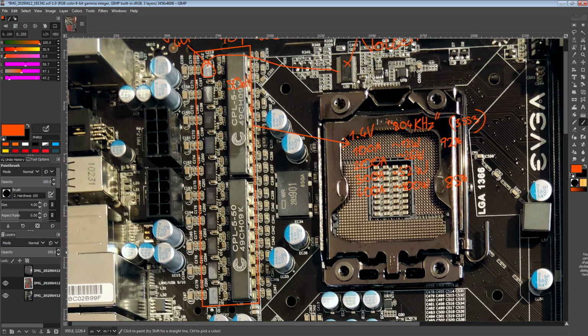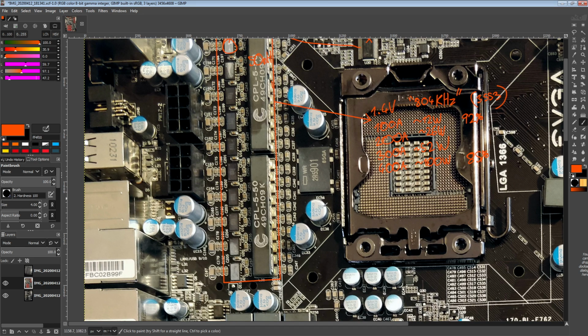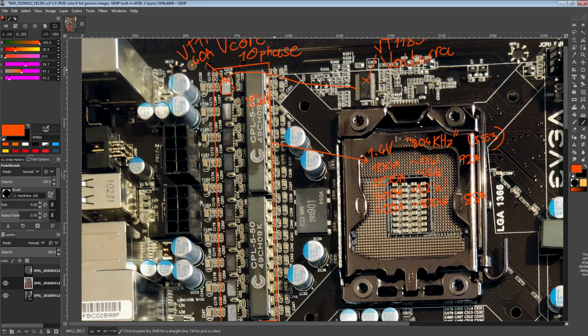not a fan of the efficiency, but a very funky VRM, and a VRM I really want to get some scope shots of, because it should be really interesting to see how this compares to other X58 motherboard designs. The other ones use a lot more conventional voltage controllers with much more conventional control schemes and much higher inductance inductors. But also, most of the other motherboards use way more output capacitance than this. This has a lot of multi-layer ceramics on the output, which should further help the transient response.